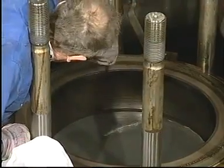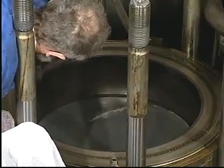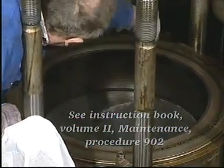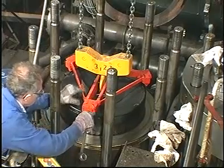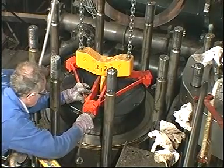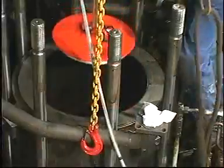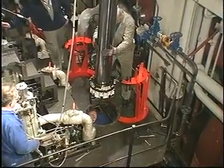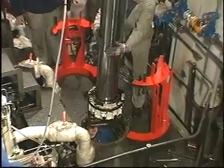Ensure that wear ridges are smoothed out and that any carbon deposits are removed. Also make sure that the piston cleaning ring, if installed, is removed from the top of the cylinder liner. Mount the lifting tool and lift the piston with piston rod and stuffing box out of the engine. Place protective covers over the cross head and in the bottom of the cylinder unit. Remove the cover from the cut out in the gallery floor plate and land the piston on the support tool.